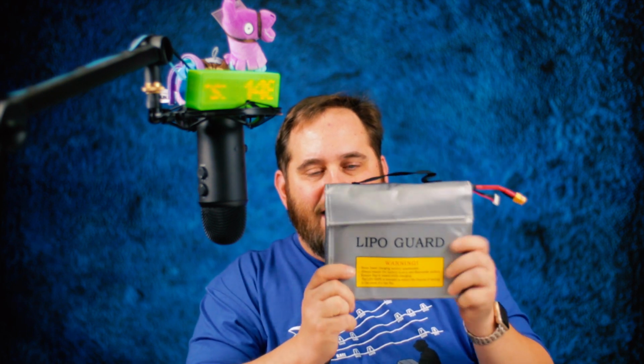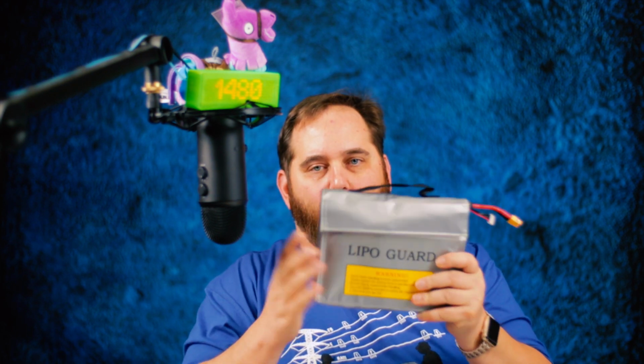Sometimes I may even charge up, I have a travel power supply, and I'll show you close up later on, but basically here it is. It's a whole bunch of old batteries that I don't trust to fly in a quad anymore, but they're certainly good enough to hold power for portable charging. So that's just one single giant battery pack to power chargers, so I can do charging in the field.